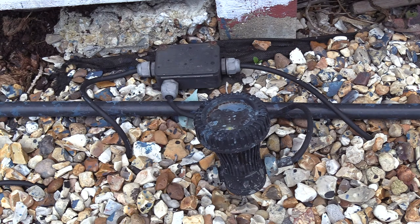Must have something else wrong. I can only suspect one of the lamps has got water in it. I haven't got a dead short, but the power supply disconnects it. Power supply works — connect it, stops working. Definitely a cable problem or a lamp short. That's for another time.